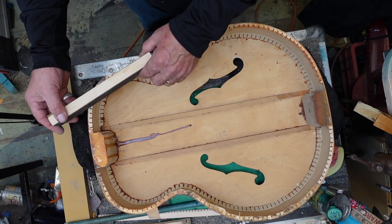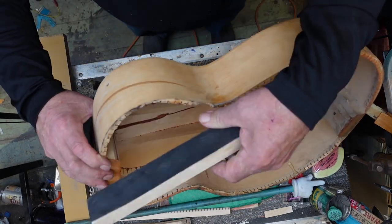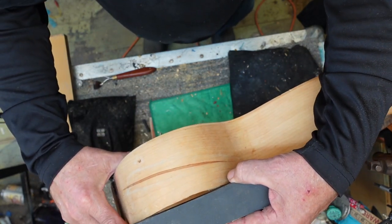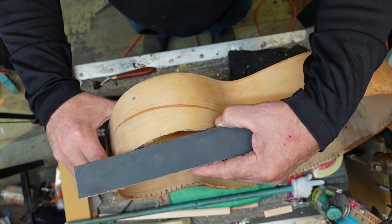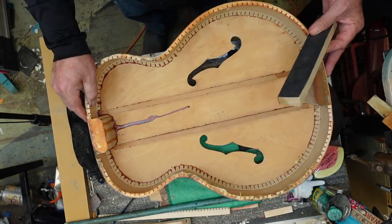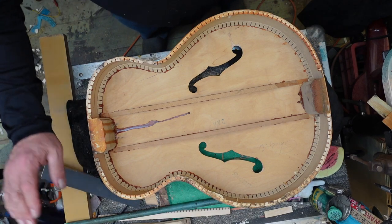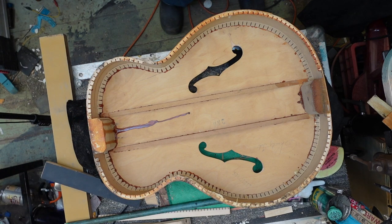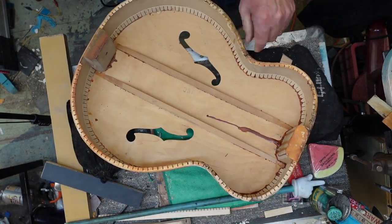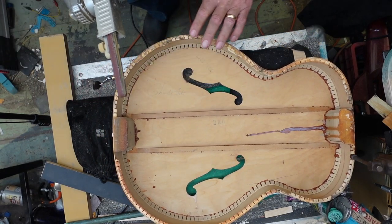We're going to end up taking a piece of sandpaper, and you can tell that there's gaps underneath. Let me tilt this up and show you. You don't get to see this stuff very often, guys, so you can tell there's a gap right there underneath there. So when the kerfing is bad, we're going to fix all that up. I'll give you bits and pieces of here, but this is monotonous. But we're going to start off with our friend here on these areas where the sides are built up with all this hide glue and stuff, or tight bond, where it never came together.